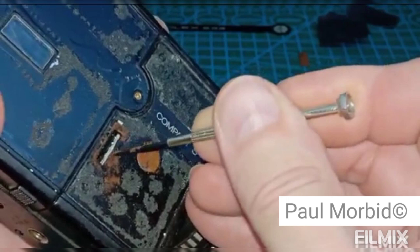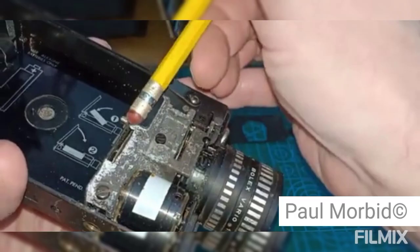It just spreads and continues to spread throughout the camera, wreaking damage to all the components, the glass, and everything. And it gets in between the wires and the wire coatings. We'll look more at that. Here we have an issue of the same Bolex Super 8 camera. It's the corrosion up inside the shutter blade. You can see it right there. It's spread all the way around, and it's just deep up inside there. It's traveling up inside the lens compartment as well, up around the motor.